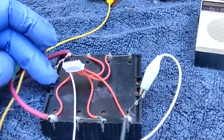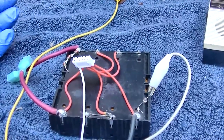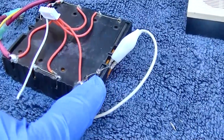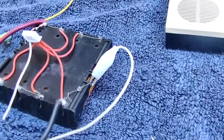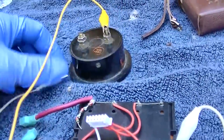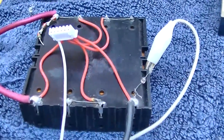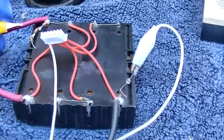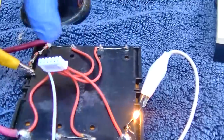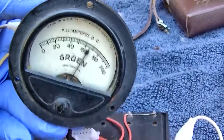So they're 3.3 volts per cell, so they're kind of ideal for radios, because radios are usually 4.5, 6, 9, or 12 volts. So that's what we got here. Now, I added an 80 milliamp wheat lamp there, and I use a little milliamp meter here. So if I connect this, you'll see the wheat lamp. This is just a current limiting light bulb, just like when you're doing a dim bulb on old tube gear. Since it's 3.3 volts per cell, the diodes basically drop it a half a volt per diode. So you can see there, that's our current limiting.